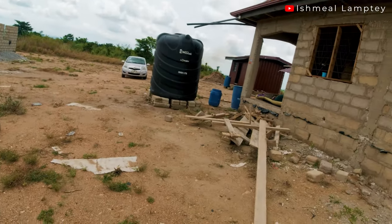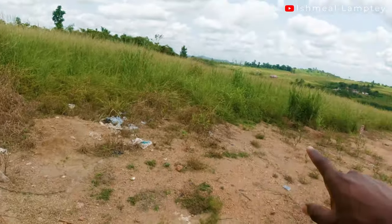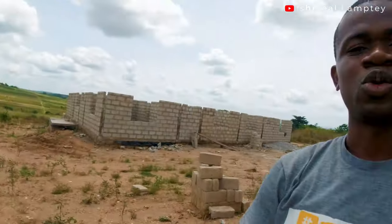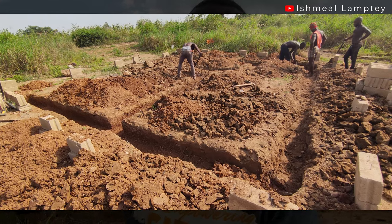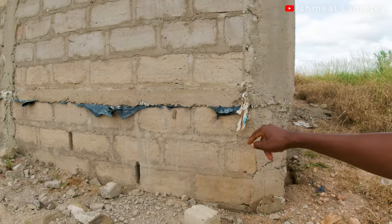Over this place, the land has a bit of slope. If you look all the way down there, you notice the slope. I was fortunate to have gotten the part on the high side, so we didn't have to do so much block work for the foundation. If you look closely, we have about three blocks above ground, and about two blocks that go down from this particular position — so that's a total of about five blocks.